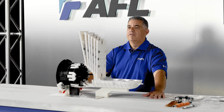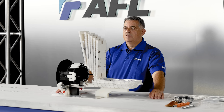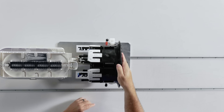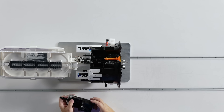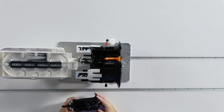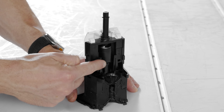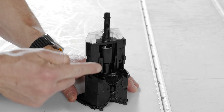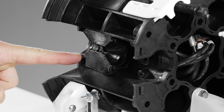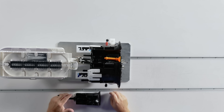If the inner basket is removed in the field for a specific application, there is a kit included of basket tabs to be installed. The base of the APEX holds the individual sealing wedges. These wedges are comprised of an outer gel block, compression spring, and the gel compression screw. There is an inner gel block attached to the base and an orange port plug, which is used when no cable is installed.